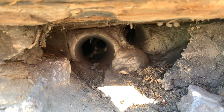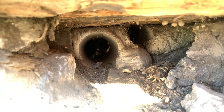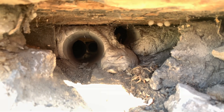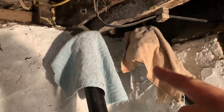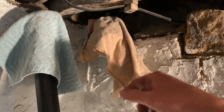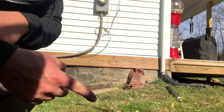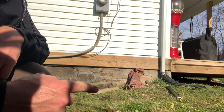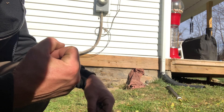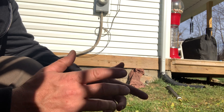The two-inch hole looks okay, but the inch-and-a-half side we're going to have to bust out. I'm going to go inside and plug up those elbows. Now that those are wrapped and plugged, we can hit any debris — it'll just fall down and we'll sweep it up later. I'm going to use a digging bar to bust out that old mortar. Watch out if you have old terracotta block, speed block, or a weaker wall — even this sandstone is brittle. Don't go crazy with the digging bar or you could literally blow out your whole wall and destroy your foundation. Just take off a little at a time and don't hit too hard.